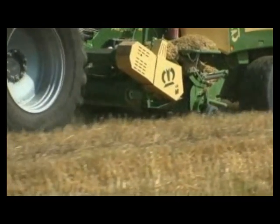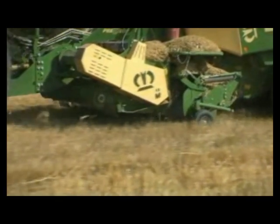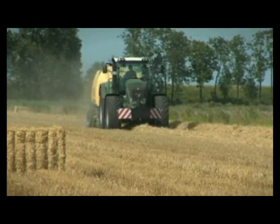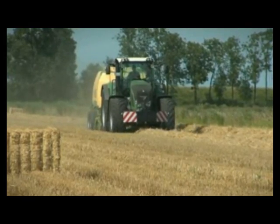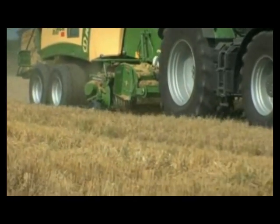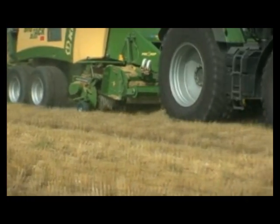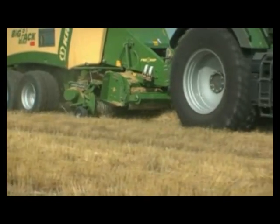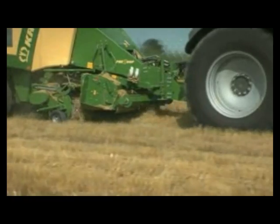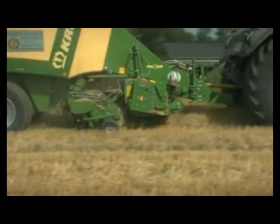HDP produces bales that are 25% heavier in weight than those produced by traditional big balers. Krone provides the appropriate technical specification to achieve these results. First up there is the flywheel. This 578 kilogram heavy duty wheel ensures smooth machine running. The massive main gearbox is designed to transmit 830 kilowatts, 1100 horsepower, onto the plunger in enduring operation in the most difficult conditions.